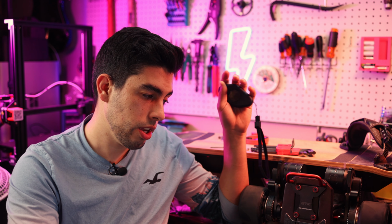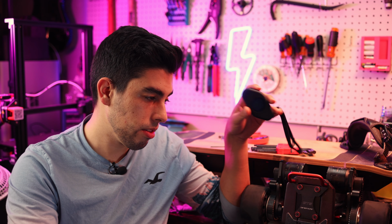One thing I will say, I ran into a huge issue with the VX4 and the DV4S on here, and it was kind of my fault, but also kind of not. So basically, if you ever have this happen, you're configuring a board, you flash the firmware to a different version, UART remote just won't work at all. Basically what you have to do is go into the control mode in VESC remote and make sure this is set to current, or whichever one you want, on both sides of the ESC separately. And then your UART remote will work. It took me forever to figure out that problem, and it wasted a lot of time. So if you ever run across that problem, check that first. VESC remote, control mode.